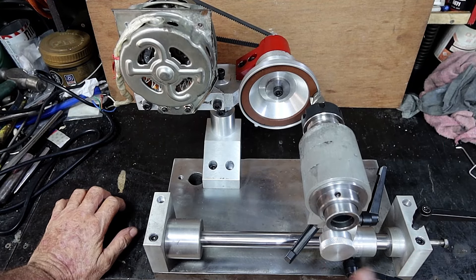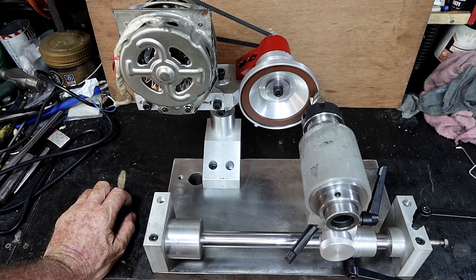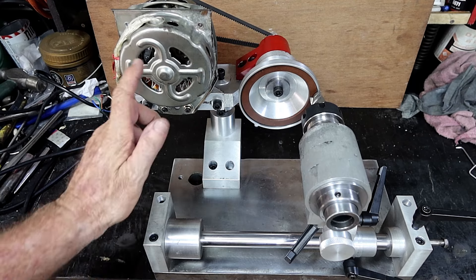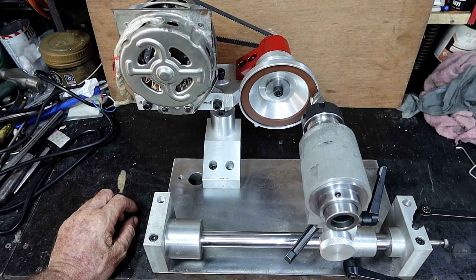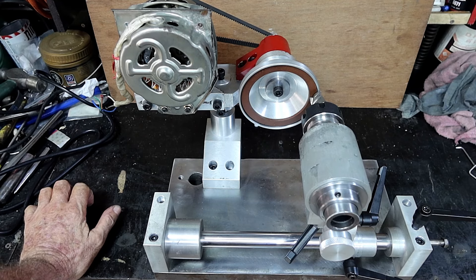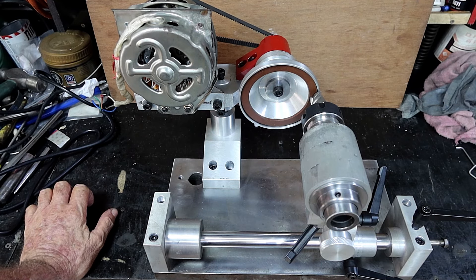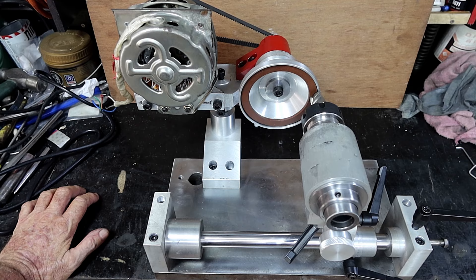While you guys weren't looking I drilled and tapped a few holes, put a few bolts in it, wired this motor up to get it to run to see how it goes. But I was probably a bit hopeful that a 70 watt motor would drive this thing - and it won't. So I'm going to have to go and find a new motor, maybe a 350 or 500 watt motor to drive it. That'll probably take a week to a week and a half to arrive. There are still probably one or two episodes left - lots of little things to do. If you've enjoyed watching, give it a big thumbs up and smash that like button. Come join me next week for part six of this tool and cutter grinder build. Thanks for watching, see you next week, bye bye.